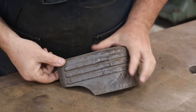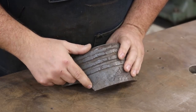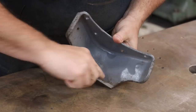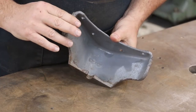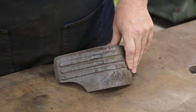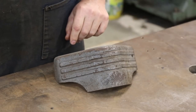Let's take a look at the problem here up close first. This is the crack right here. Hopefully you can see that it starts here at the outside and runs up to about here. And when you flip it over, it does go all the way through the casting. So I think we'll start by getting all this old paint off of here. He's going to be repainting this anyway, and that's just going to be contaminants to get into a brazing job. So I'm going to get this over to the wire wheel and get her cleaned up.